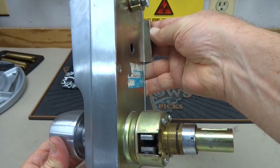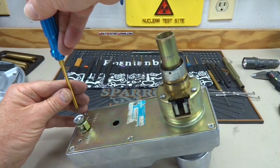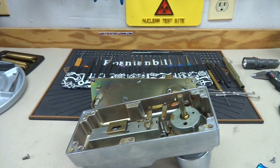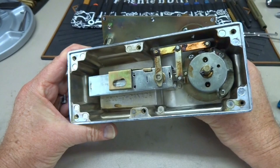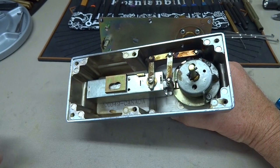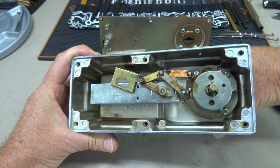Once inside, you can remove the back and change the combination. Let me show you how the Magneto works — I'll go into fast motion. We've got it open. The magnet is so powerful it goes right through my finger. Inside, when we turn the knob without the Magneto, watch the linkage — it collapses right here and won't allow us to open the door. When we put the Magneto on the side, a little flag pops out, the linkage no longer collapses, and now we can open the lock. Really amazing stuff.